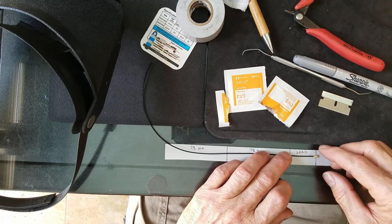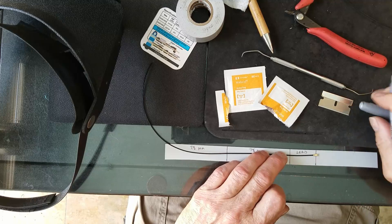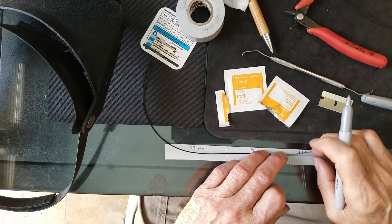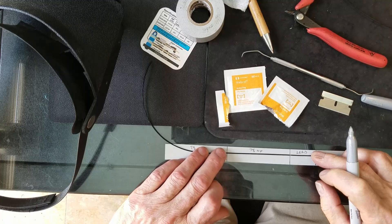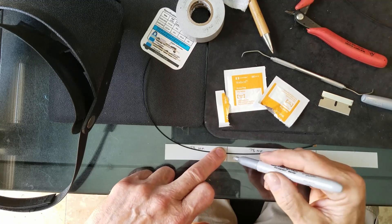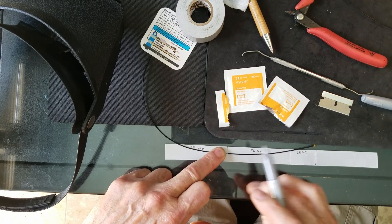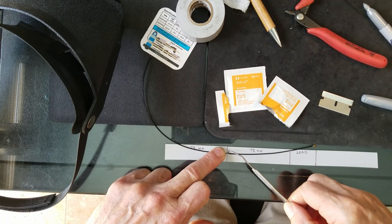Lay the thing out and hold your U.FL connector at the lead mark. Take your silver Sharpie and put a little mark right where the lead ends — the Sharpie doesn't really want to stick, but just get a mark there. Up here is where you're going to cut the vinyl coating back, so put a fat mark there and cut right at the center of that Sharpie mark.